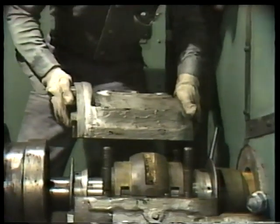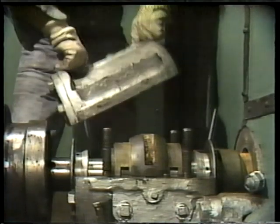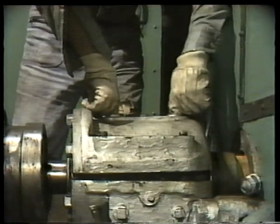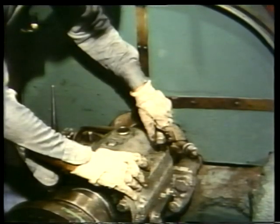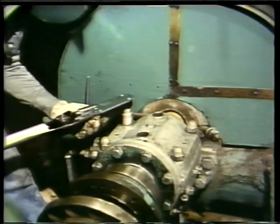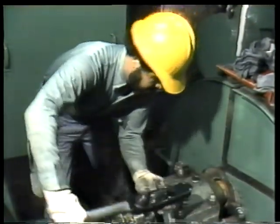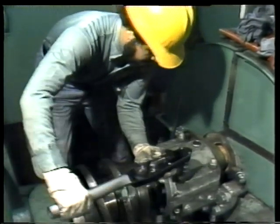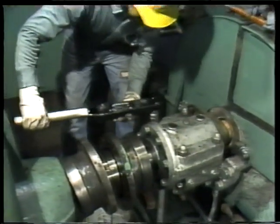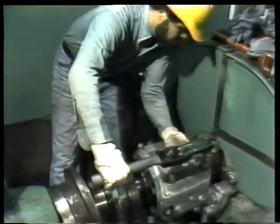The bearing housing also has to be in place and torqued down to the proper value before you'll get an accurate measurement. Before putting the housing on, make sure there's a gasket on it — otherwise your clearance reading will be smaller than it will be when you replace the gasket during final assembly. Lower the housing carefully into place using a finger through each observation hole. Screw the housing nuts on by hand, snug them down with a wrench, and then torque them to the proper value. Whenever you torque down housing nuts, use a criss-cross pattern, going to the diagonal corner each time, until each torque reading matches the specs.